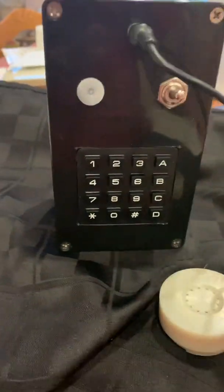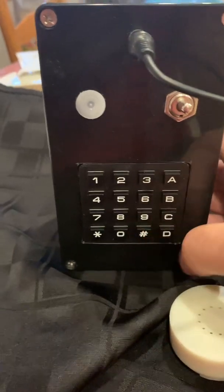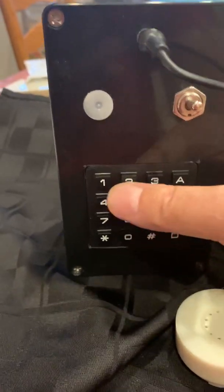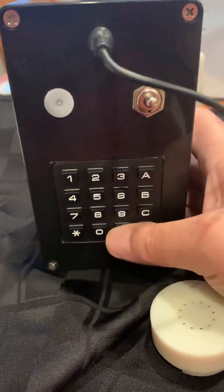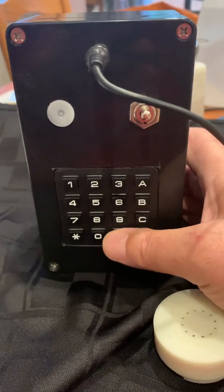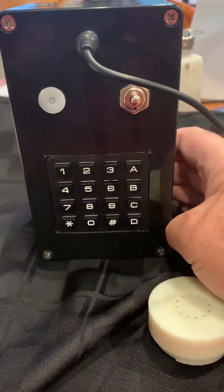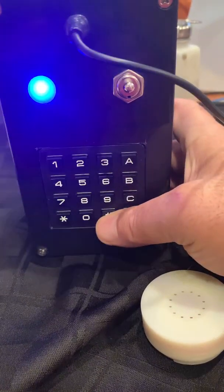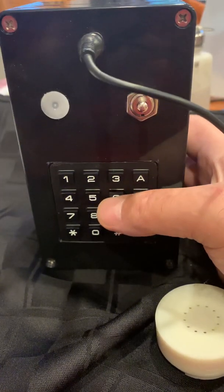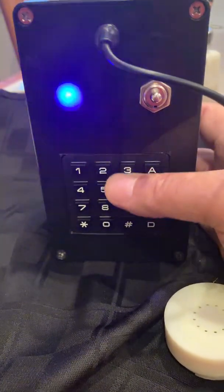Mode ten, on the star key, is the Improved Mobile Telephone Service (IMTS) mobile phone automatic number identification mode. If you had a radio on the frequency of the old pre-cellular IMTS system, you could key up your radio and play these tones to get a dial tone back from the base station. It used a 20-pulse-per-second system — double the normal dialing speed — sending the encoded identification of the mobile phone to the base station. If it passed, it would return a dial tone, after which you could dial using a 10-pulse-per-second rotary dial system.